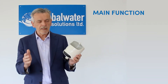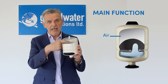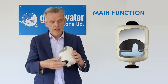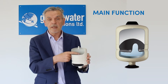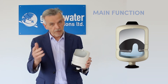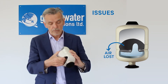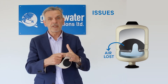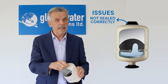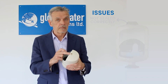The job of an expansion tank is quite simple. This is where the air goes — the pre-charge — and this is where the water goes. All it's got to do is keep the air in here, and then everything is good. The problem is air will usually be lost through this material, and if you don't seal it correctly, it will be lost through the Schrader valve.